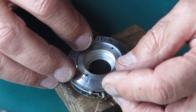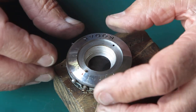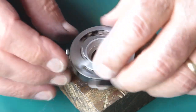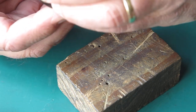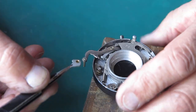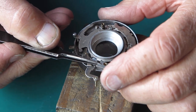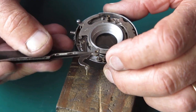Interestingly, there is nothing holding this trim ring on the front of the shutter except the central lens element - that's a bit of a departure from normal practice. So far so good, I'm happy with the state of that. I need to put something back in the shutter - we have everything here except the little lever that stops you depressing the shutter release while the shutter is uncocked. This little piece here fits over this post. Where does it fit? It must be swung in, so the spring presumably fits over that side of the post.